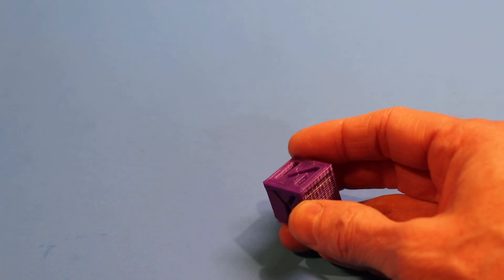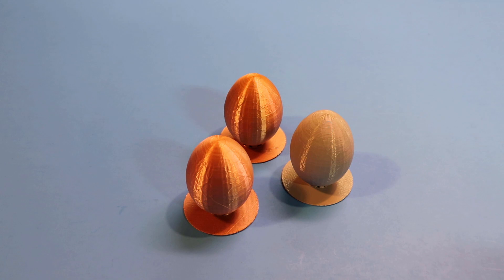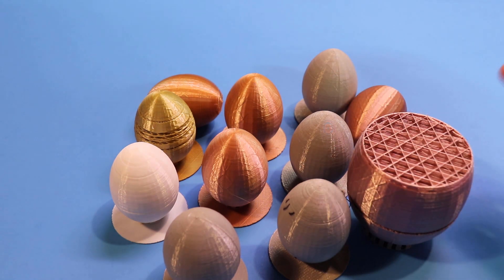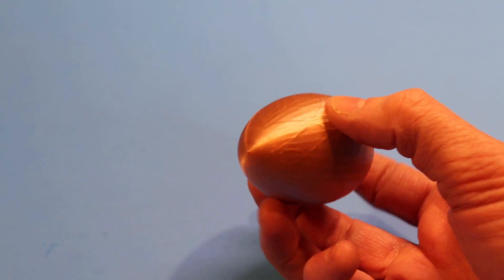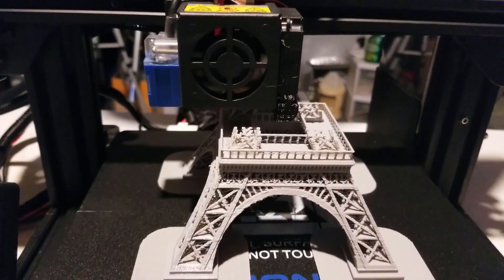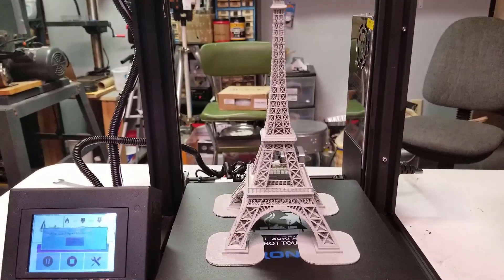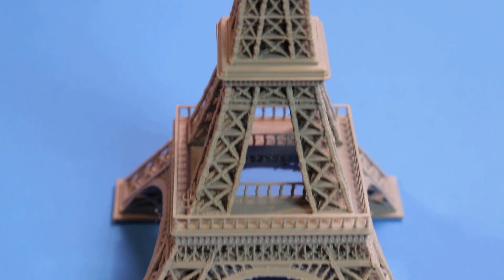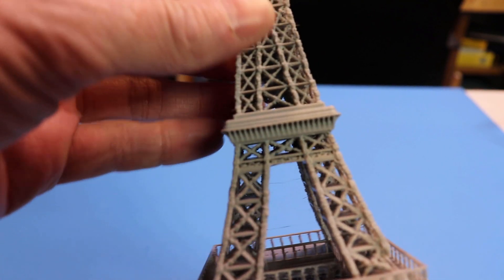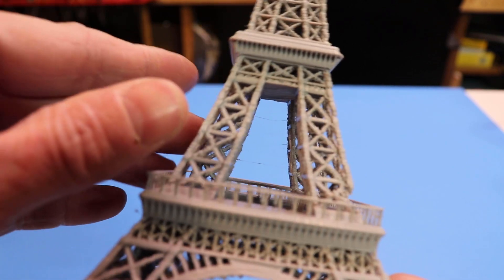I printed a test cube and a benchy that both turned out pretty well. Then I went to printing eggs — a good time to stock up for Easter, and they're easy to scale and quick to print in about an hour each. I got a little layer separation a few times, but temperature adjustments seemed to correct this pretty well. I also tested the tolerance and the build volume with this amazing Eiffel Tower from Thingiverse, which I've linked in the description. I scaled it up 200% to make it 250mm tall and printed it without supports but with a raft. I was really happy with how it came out — a little grainy in some of the finer spots and a small failure in one spot, but overall very pleased. With a couple of slight adjustments, this could be made even better.